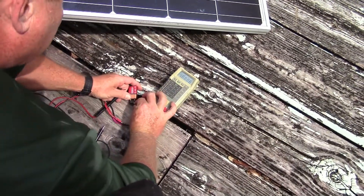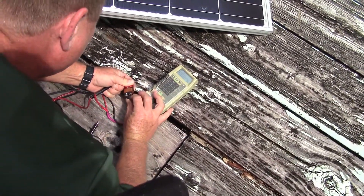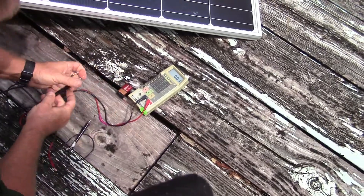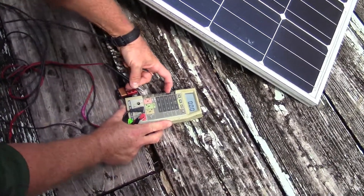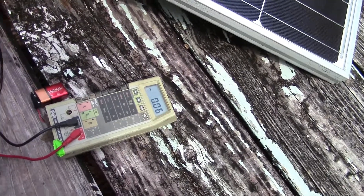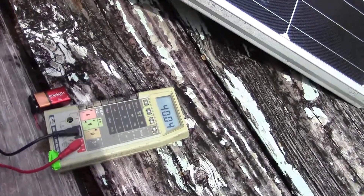The battery needs to be hooked up correctly. Let me hook up this battery to the meter — little 9-volt battery. We're kind of rushing because there are some clouds. Being that it's Florida, we often get clouds. So you'll see it should be about 42 volts. We got about 39.5 volts. I just had the leads mixed around. So you see 39.7 because there's a little bit of cloud now.